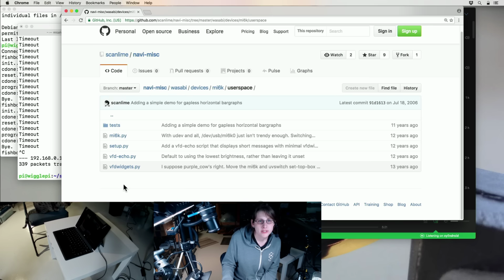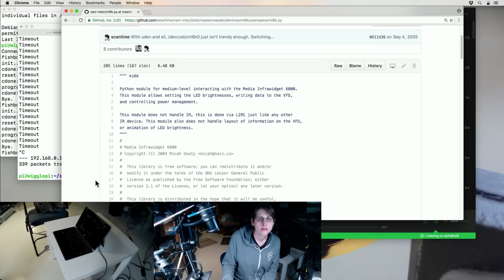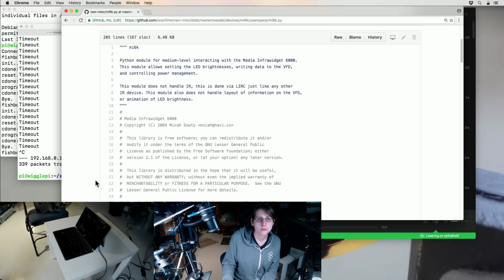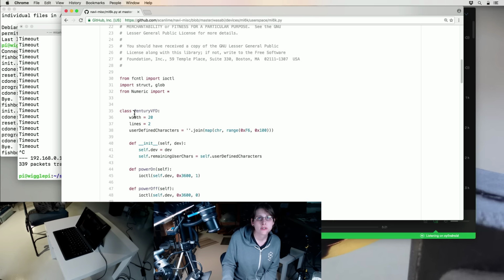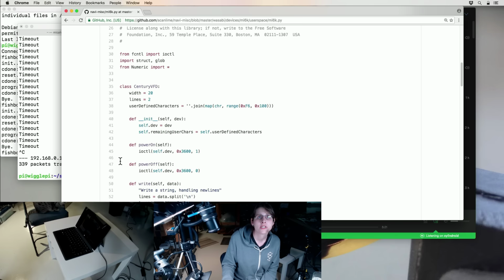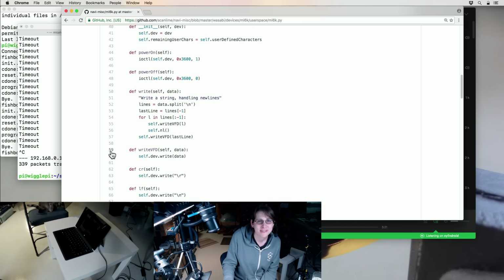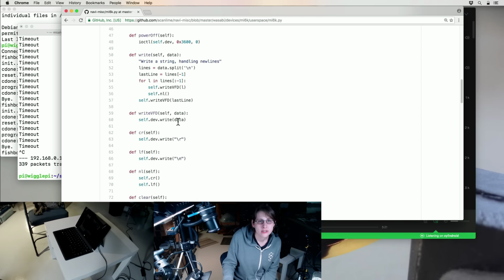Oh, I guess I had some stuff that didn't use... This might be easier to adapt, actually. I had a Python thing. Oh, how does this work? Oh, this talks to the kernel module. Of course, it just doesn't use LCD proc. So it's using those I/O controls to tell the kernel to tell the USB over control requests to turn the power on and off. This write VFD...